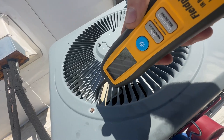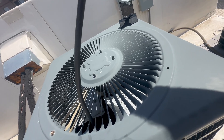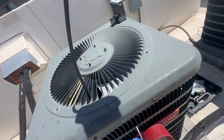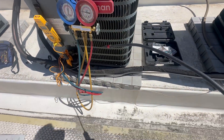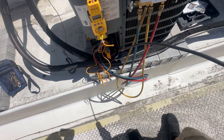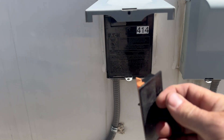I'm still going to do a quick sweep on the condenser even though I'm very sure that the evaporator coil is leaking. I've been burned before where I've condemned one coil and the other coil leaked too — and it's not that uncommon on a unit that's over 10 years old. I don't really see any signs of oil out here, though you don't always see signs. I did not pick anything up out here, so I'm going to reapply power.